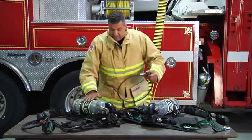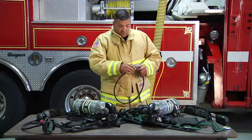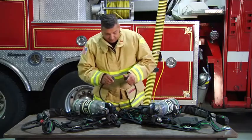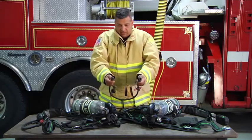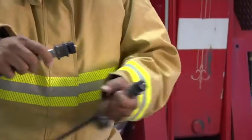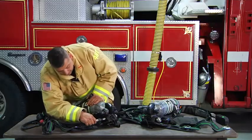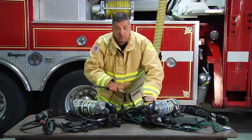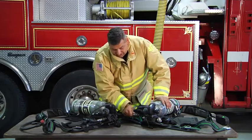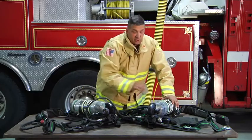My bottle on my back is flashing green — I'm the member that's going to transfer air from one to another. I'm going to disconnect and connect to the member that needs air. With our connections, we don't have to worry about playing with quick connects. All you do is push it and this collar will lock in place. When I take it and push it in, you hear that audible click and it's locked in. Then I go over to my member that needs air and do the same exact technique — find it, set it in, and push. You can hear air transferring from my tank into their tank.